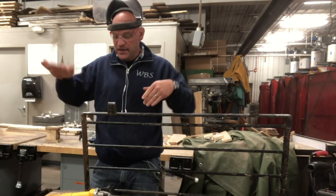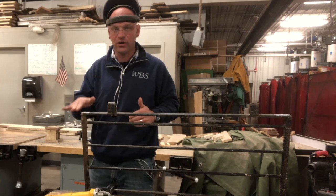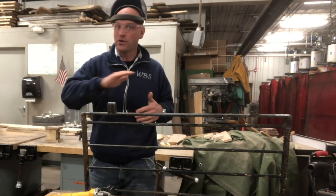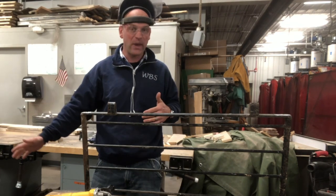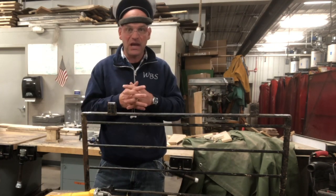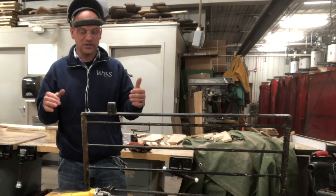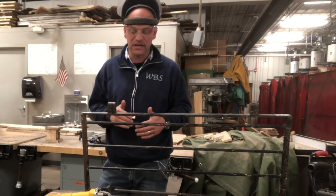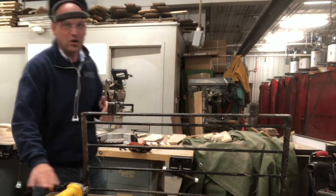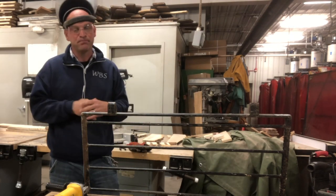I just did a little grinding and the sparks went from here all the way around back to here. How I position the grinder on that steel, I can make the sparks go in a certain direction. What I do not want to do is throw sparks on another student or a person that's got their back turned. I don't want to throw sparks on an acetylene tank, a propane tank, or on something flammable — maybe a piece of wood or sawdust. I want to position myself and the grinder so I'm throwing the sparks in a safe direction. I'll even get one of those red curtains and position it so I'm throwing the sparks against that, which is perfectly acceptable — you can throw all kinds of sparks against those curtains and it's not going to hurt anything.